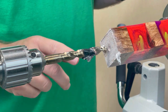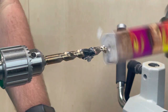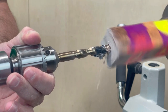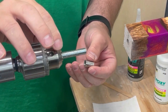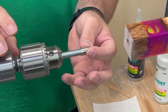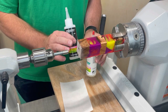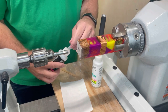This is a 7/16th drill bit, and I have tape on there to go as deep as I want to go. I've got a 3/8th bolt and I cut the head off of it so it'll go in the Jacob's chuck. Here's the insert, so I'll just put that on there like so. And now we have Z-Poxy — this is a 30-minute epoxy — so I'll go ahead and do this one. I'll get it pressed in there, equal parts of this. I'll go to lunch and come back and do the next one.